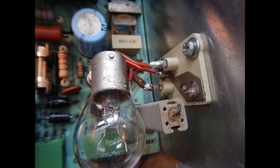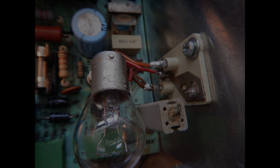However, with a 30V B+ voltage, the choice of a suitable lamp is quite difficult. All I could find in my collection is a 24V 1A lamp. This one will probably glow even on a correctly working circuit. A good choice is usually a lamp with about the same current rating of the B+ fuse and a working voltage as close as possible to the actual B+ voltage. But incandescent lamps are getting rare nowadays.